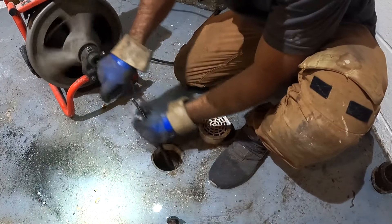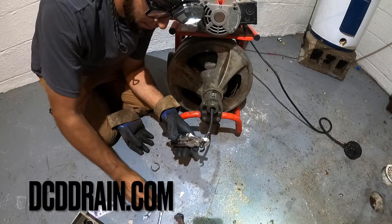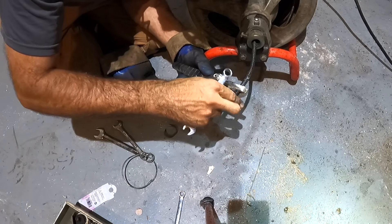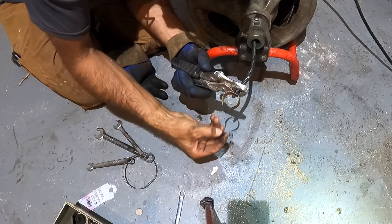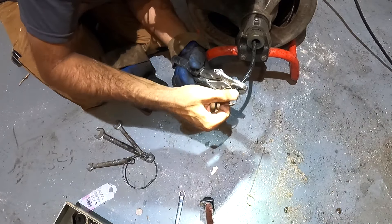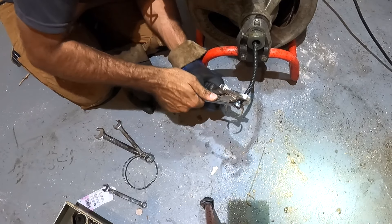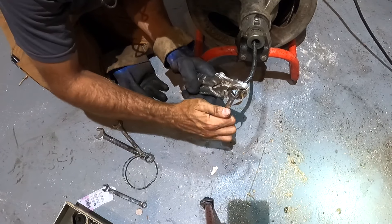Some of you may know I've switched this cable out for a Drain Cables Direct cable, so my end is probably going to be different than yours. Mine's a 7-16ths with just a nut on the end. I like it so much better than the setup that RIDGID has. I just grabbed some vice grips, used a 7-16ths wrench, and switched the cable out. I don't have too many blades for this machine, so I need to order some more from Drain Cables Direct — not sponsored. I've just had extremely good luck with their cables. I do like trying to use vice grips here on these.